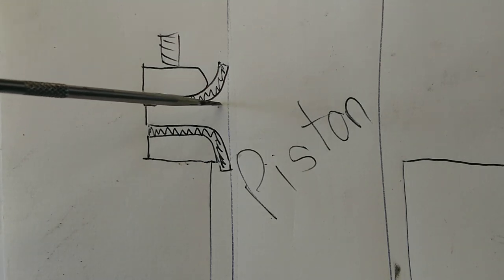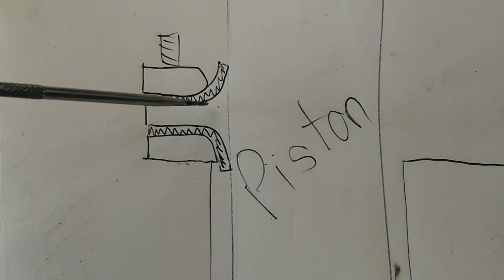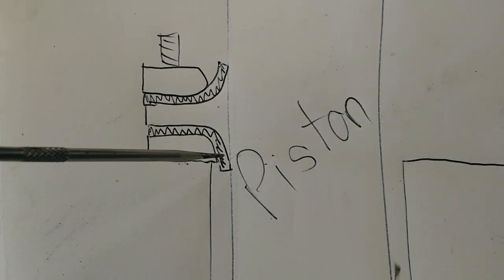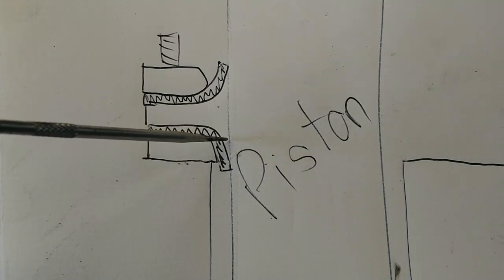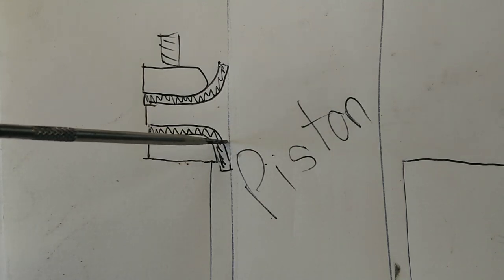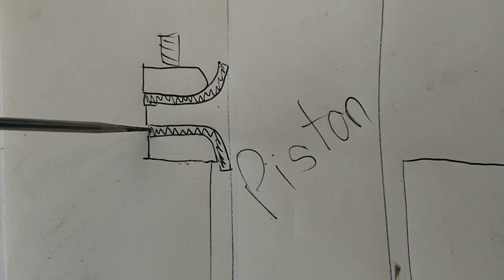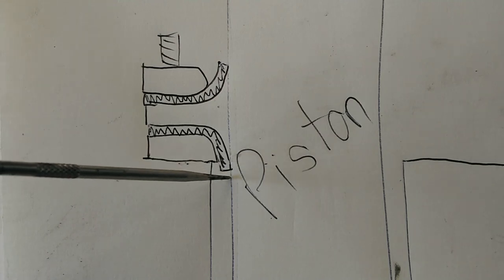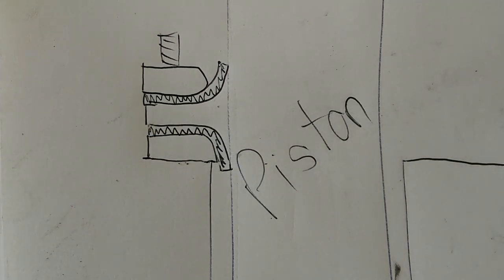This piece here is like a filler piece. This is a support ring that used to support the leather seal. So when the piston was going in the upward direction, according to the patent, this leather seal would have a tendency to get squeezed up if this support ring wasn't here. I'm wondering whether if I replicate this, I could use the leather seals again and it might solve the overheating problem — which may have been caused by the extra friction or drag of the seal rather than the actual heat of the engine.